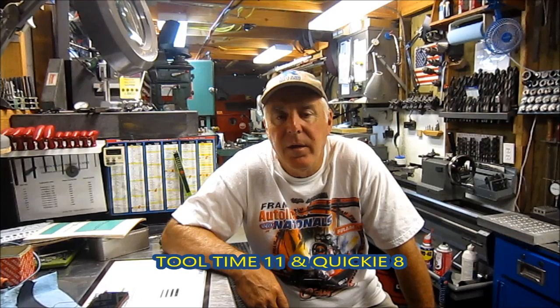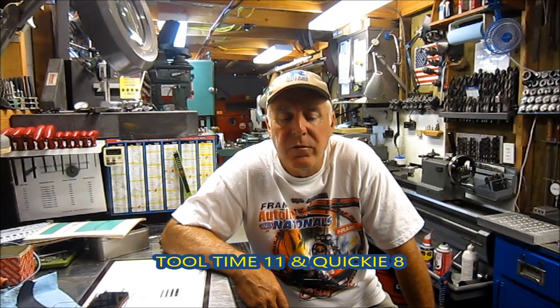My buddy and mentor Chewy stopped by, and that's what this video is really about. He had a three-jaw chuck that he needed to get trued up so he could use it on his Stark lathe. There's some video I did earlier where I helped him on an indicator holder for it. We trued the jaws up here on the machine, and when he went home and put it on his own machine, the total indicator runout was just a touch over one thou — it worked out really well.